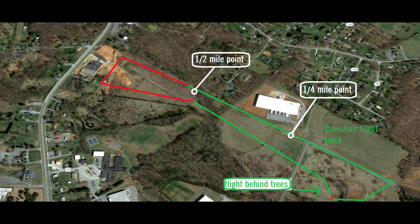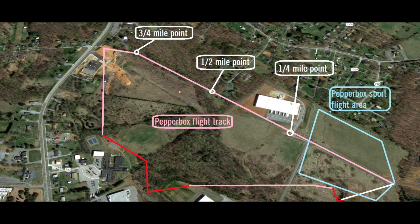This is the crosshair's flight path. I took it out a lot further than I did the helical, because I was surprised the helical made it as far as it did. Once I passed the half mile point, the crosshair really didn't deliver enough to go any further. I don't know of many mini quad race courses that would get close to half a mile, let alone beyond. Interestingly, the interference behind the trees with the crosshair was significantly less than with the helical, though there were a few places where it wasn't flyable at all. Last but not least is the pepper box map. In the lower left hand corner the signal wasn't usable — partially from getting out of the pepper box beam, but also from Fresnel violations where I was flying behind objects. When I flew behind the trees at close range, it didn't perform quite as well as the crosshair. The area in pink is where the pepper box performed well and was adequate for racing.